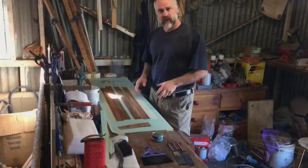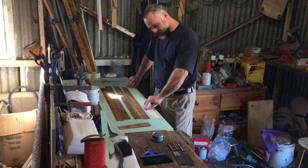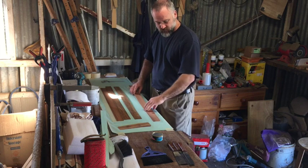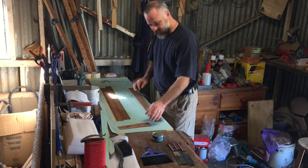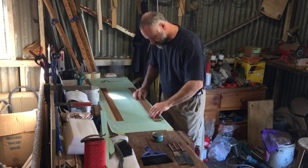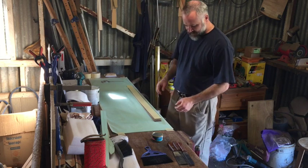I'm going to glue them all up, put them into the moulds. I've got all the pieces here for my first limb. There are nine pieces all up: first the fibreglass, then on top of that the half-mil decorative timber veneer which is Tasmanian blackwood, then my three parallels, then the wedge, then my taper, another decorative veneer, and finally the other piece of fibreglass. That's how it goes.